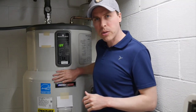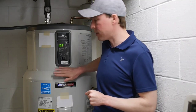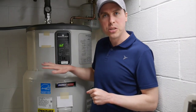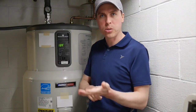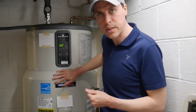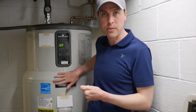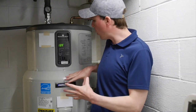If you know a little bit about the history of heat pump water heaters: Bradford White actually got this basic design from GE. GE had something called the GeoSpring heat pump water heater, and GE eventually got out of the business — they sold the tooling, technology, and everything to Bradford White. So Bradford White continues to build what are essentially GE GeoSpring units, though with some changes and differences. This 65-gallon size is kind of wholly a Bradford White creation — GE never had a 65-gallon; they had a 50 and an 80.